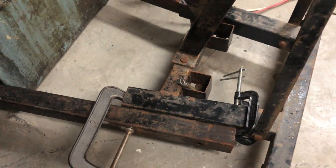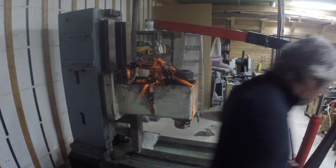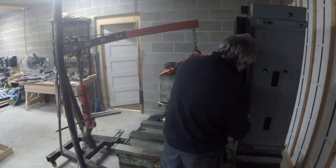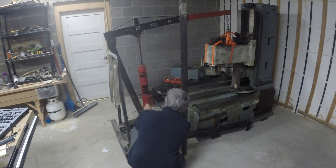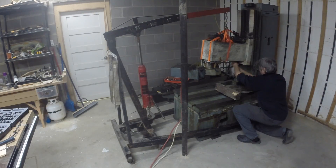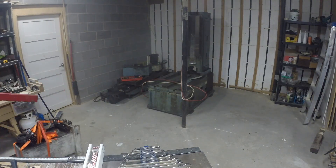It's a bit scary here. I'm loosening all the screws that hold the blocks on each side, but I'm leaving a few threads. Then when I lift with the crane, I can remove the screws one at a time and release the part very slowly so that nothing goes wrong and I can control how it's released.